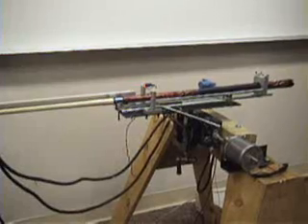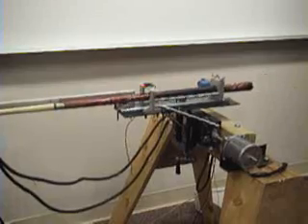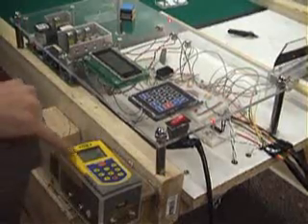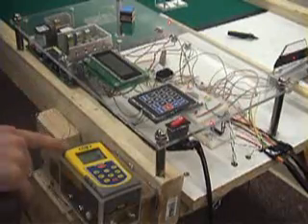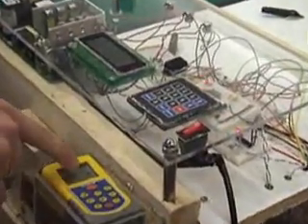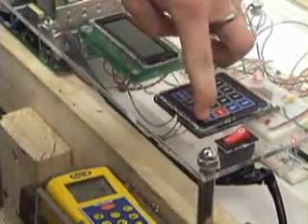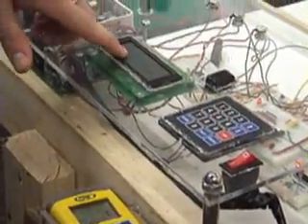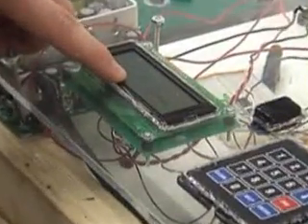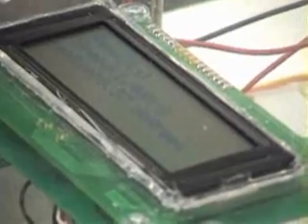The next is going to be our fire sequence. It'll buzz and the actuator will fire. We entered the distance measurement off of the laser distance finder — it says 2.613, so we enter 613 and press enter. It shows that the ball was traveling at 1.4 meters per second, and we had 3 tenths degrees of angular deflection.